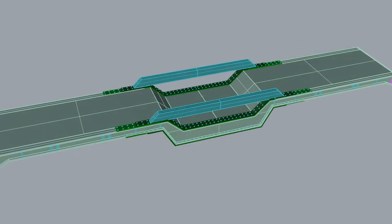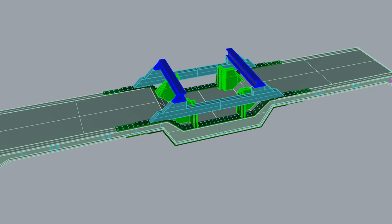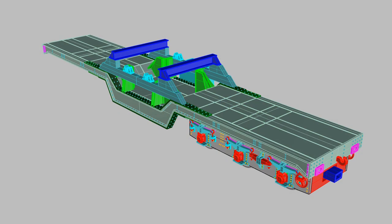And next, I set about constructing the support system for the flask. Two square section beams, and then a secondary short beam on top, and then an I section linking the two together, into which was fitted corner capture plates, which snugly cradle the flask. Finally, I made four locating shoes for the legs of the cover, which is placed over the flask when it's in transit. And the wagon is pretty much ready to print.